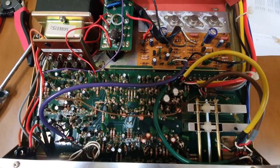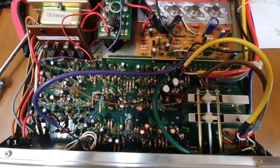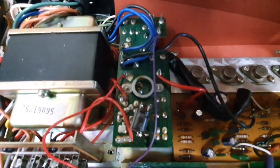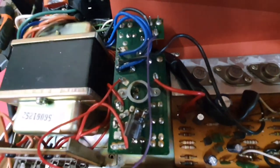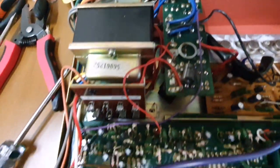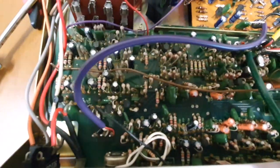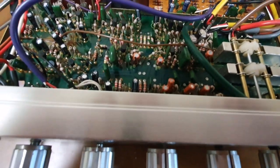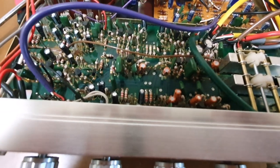The cover is removed and you can see I've already done quite a bit of work. I've recapped the amplifier board, I'm going to get around to finishing the last bit on the power filter board, and here's the SQ board which I have already done most of. Right now I'm just going to target what looks like seven little orange capacitors that remain.